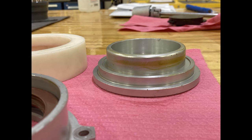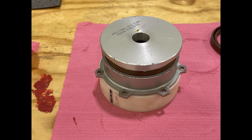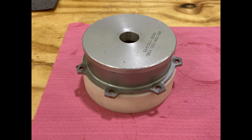That's the drift right there. It's got a little bit of grease on the outside, so when it goes into the seal, it doesn't wreck the seal. You have the seal on the drift, and now the drift is pushing it inside the seal housing cover. You could do that with your hands, just put your body weight on it. I mean, especially if you're like me and you're pushing 220 on a hoof, right?